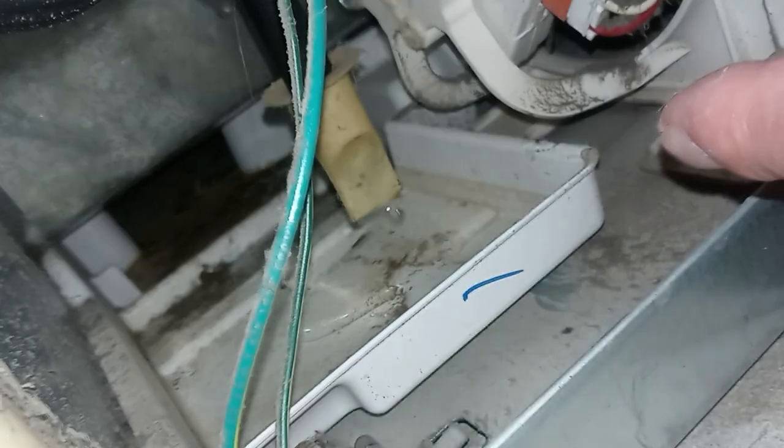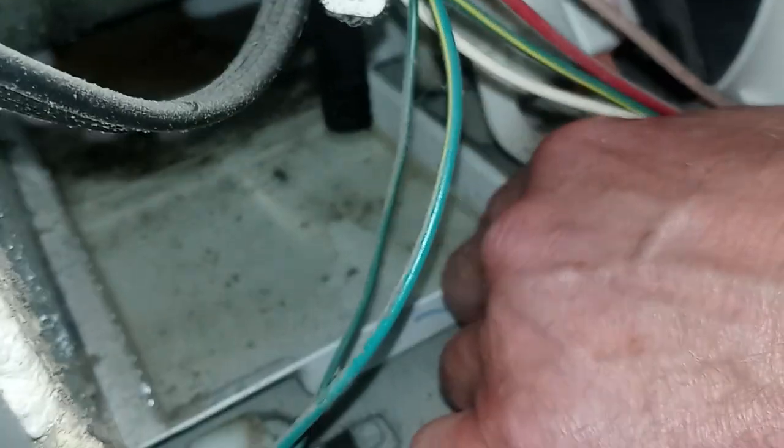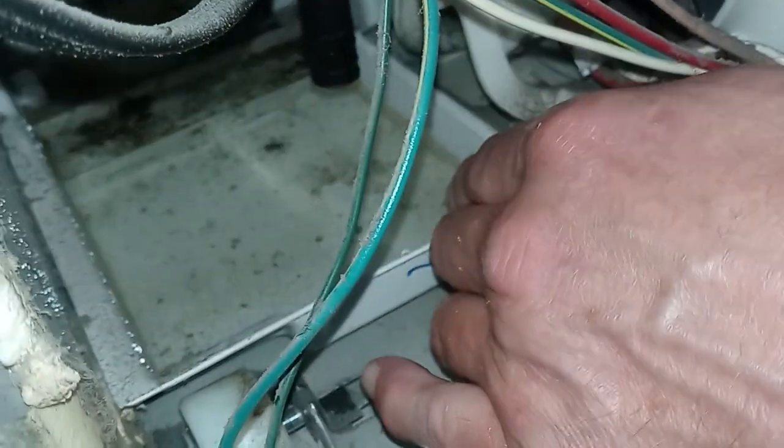But yeah, yay! Look at that. It's dripping out. So that means we're definitely making some progress. Hooray. We'll go back up to the top of the fridge. You can turn it off now. So I took off this little membrane. You see how the whole thing is to keep the dust out. And look what happened. Look, guys, see? I took the membrane off and the water just came flowing out of there really fast. And now this drain pan down here is about halfway full right here.